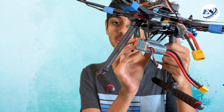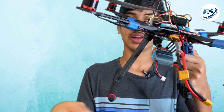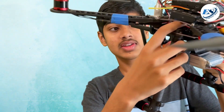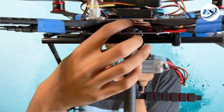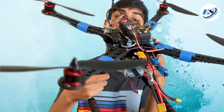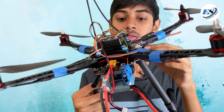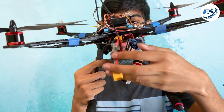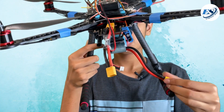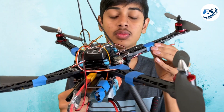The main additional accessory is the battery — obviously, you need to power the drone. The battery connects to the flight controller and to a power distribution board, which you can't really see because it's on the bottom plate, lodged between the top and the bottom. The only things connected to the power distribution board are the ESCs. The ESCs are directly connected to the power distribution board, and this connector is basically soldered onto it, so when the battery connects, it can power the ESCs, which then power the motors.